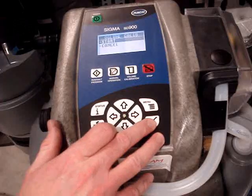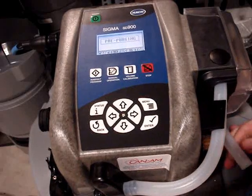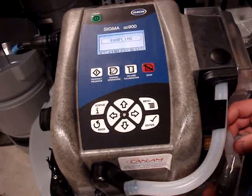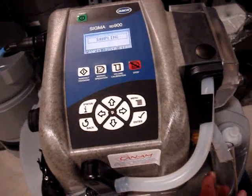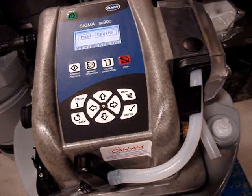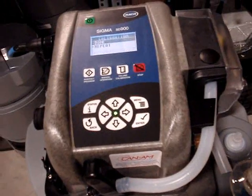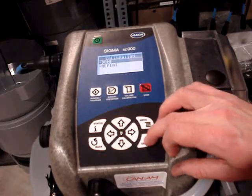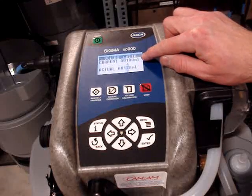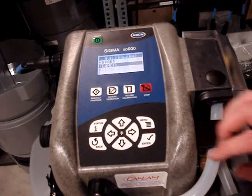Have everything set up here. I'll grab my graduated cylinder and pop the tubing off here — that's purging out the line. Pump a sample into the graduated cylinder. It's reading a little bit low, about 90 milliliters. So I go back, hit enter, and now I tell it — it thought it pumped 100 mils — I'm going to tell it it pumped 90. And now it's calibrated.